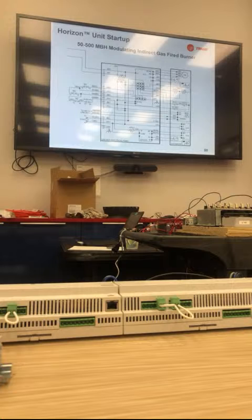Did you eliminate something and correct something else? Remember the site that you came up to visit one year, they were back to back, and the customer didn't want re-entrainment of combustion products. We haven't seen that a whole lot. I think it's just with the regular layout, like going back into the inlet of the unit. Well, the way they were set up, the inlets were opposite of each other, but because of the winds and the building setup and everything else, the customer wanted to ensure that we weren't getting products of combustion re-entered. Into the space though? The first phase, yeah. Okay.